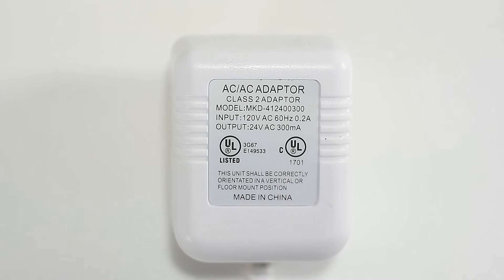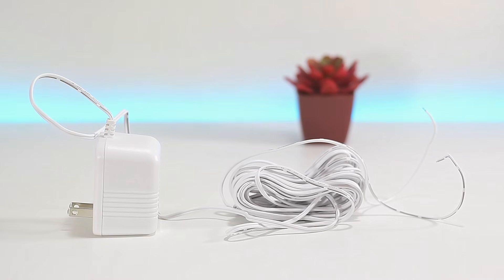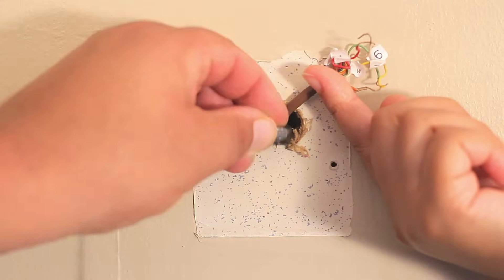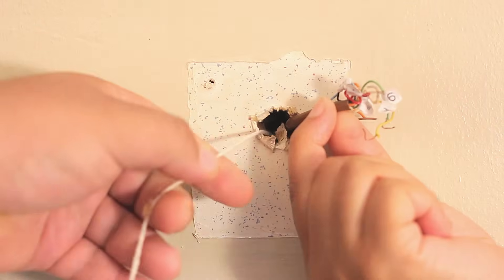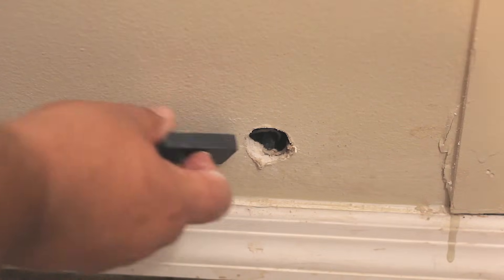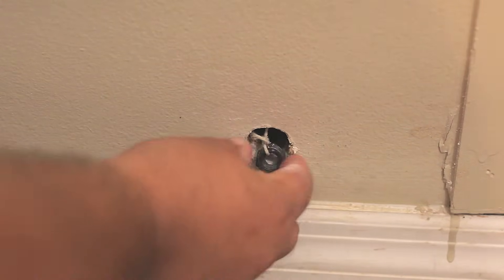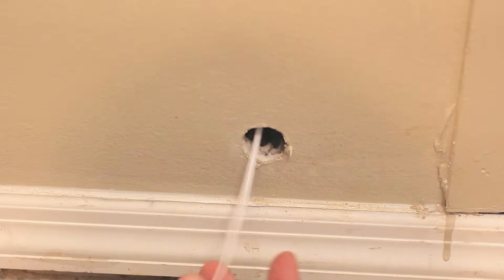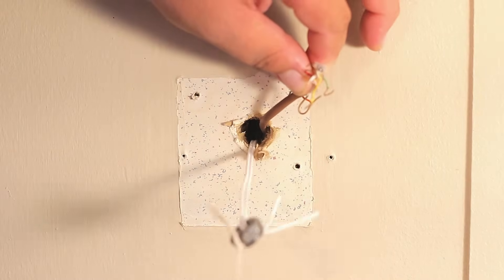But if you don't have a C wire, you can use an adapter — the only difference is it will need to be connected to an outlet. The best way to hide the cable is to run it inside the wall. We're going to use the old method of string and nut: throw the nut with the string through the hole, let it drop to the floor, then drill a hole at the bottom and use a magnet to pull the nut out. You can also use your fingers, but the magnet is a lot faster. Alternatively, you can just run the wire on the outside, or remove the baseboard, make the hole there, and replace the baseboard.